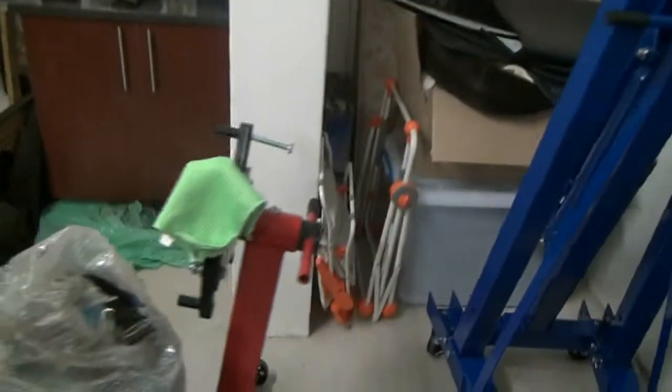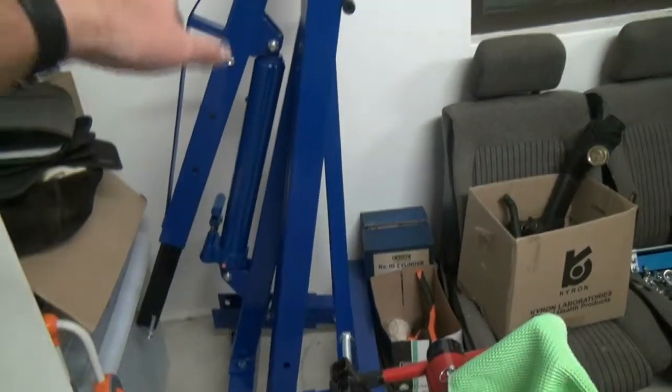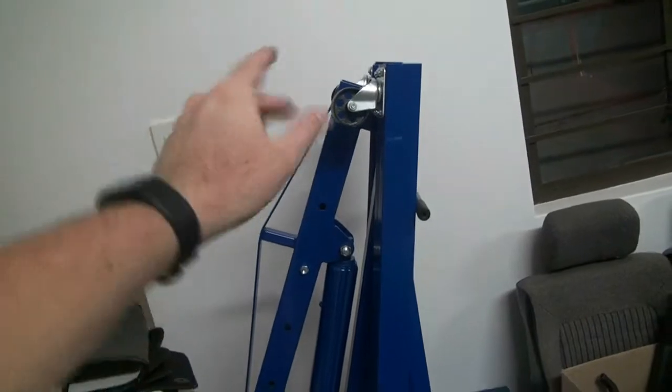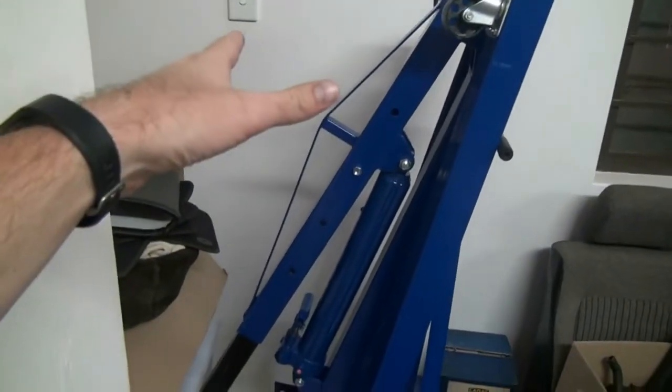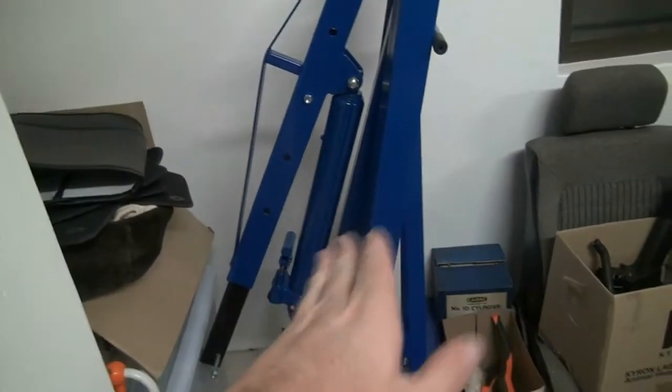And then I made a stuff up - a big stuff up. So when I put this thing together, these smaller wheels at the top are meant to go under there and these bigger wheels are meant to go at the end of these legs. What's happening now is when there's load in the front it's tilting forward, because the wheels in the front are too short. All the weight shifts forward and I have to stand on the back to counteract the weight in the front, and then someone has to push me, the crane, and the engine around. That's not ideal - I need to be able to work on this myself. So I want to focus on the brakes first before I deal with this.